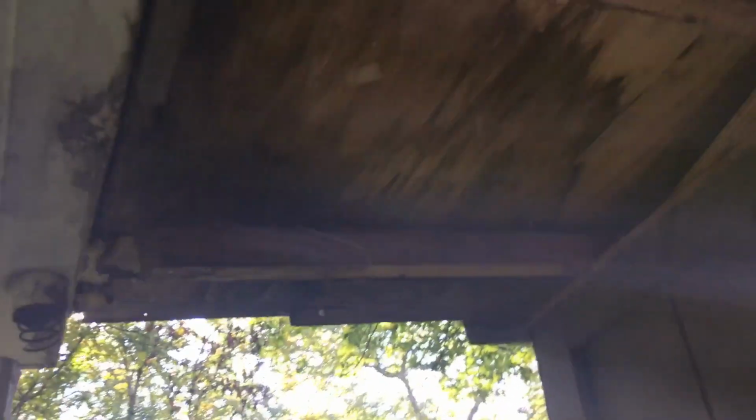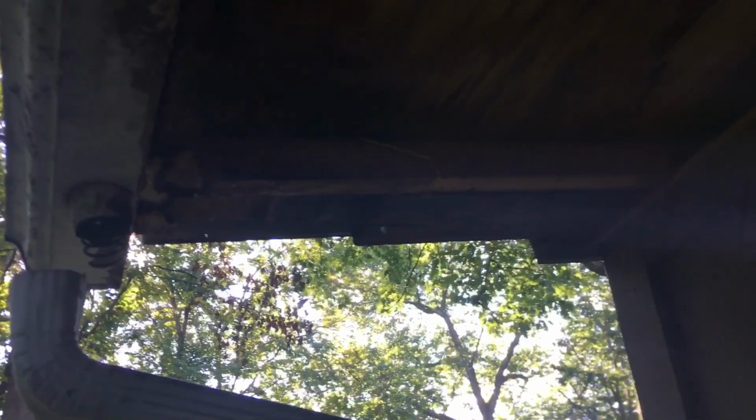I'm gonna rebuild the fascias and soffit here. I mean, it's pretty solid, it's dry, okay? He doesn't want to replace the entire thing, so we're gonna keep the best parts up there, which are in pretty rough shape. I'm gonna have to sister a 2x4 to get that front rafter all the way to the edge there so I can put that fascia on. So we got a little bit to do here. Stay tuned.